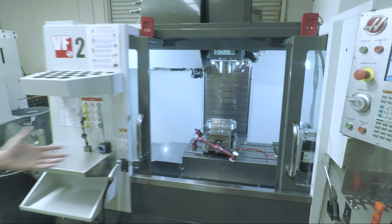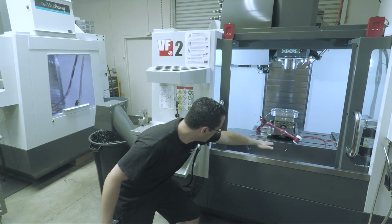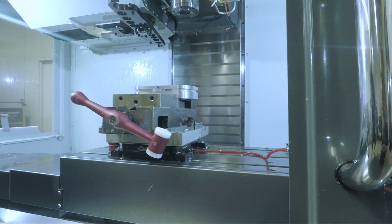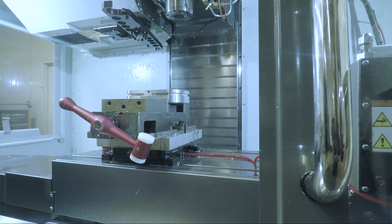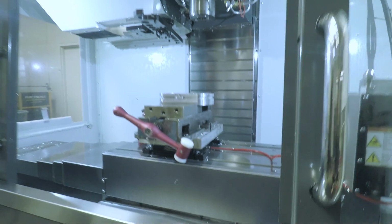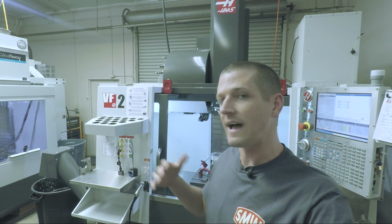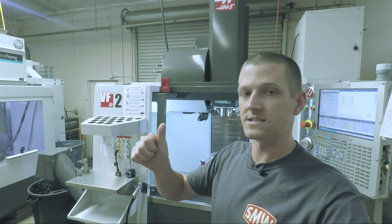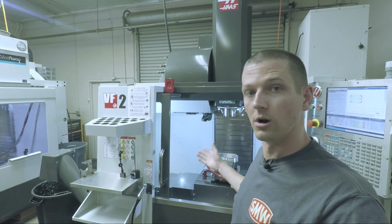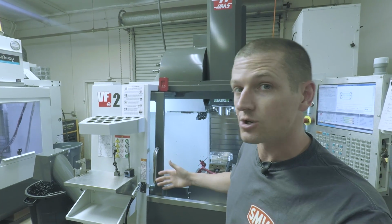So this is actually what you were just talking about. Our speed change base, our pallet, our vise, and then the part. So there's not a lot of stack up. It is more. I mean, that's going to add 2 1/4 inches, I believe. So my gut reaction is it violates all these rules. I've got money invested in something that loses Z height and costs more weight, and you're not gaining rigidity.